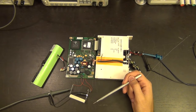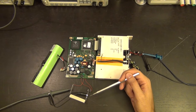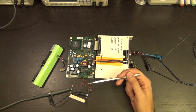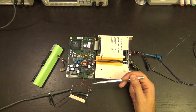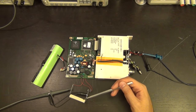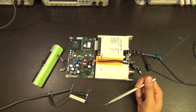Here's the setup: I've connected a higher-current MOSFET with a 5-ohm resistor in series with its drain - two 10-ohm resistors in parallel - and I'm monitoring the voltage across the 5-ohm resistor with the oscilloscope. The PWM signal on the gate will turn this MOSFET on and off, inducing current in the coil which then has nowhere to go but through the resistor. This obviously won't run the DC-DC converter efficiently, but I just want to see how much current goes through and if the MOSFET survives.